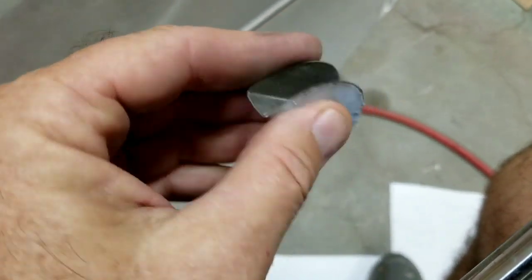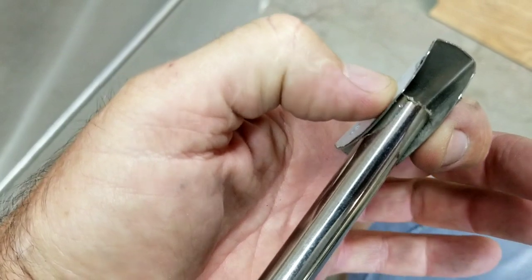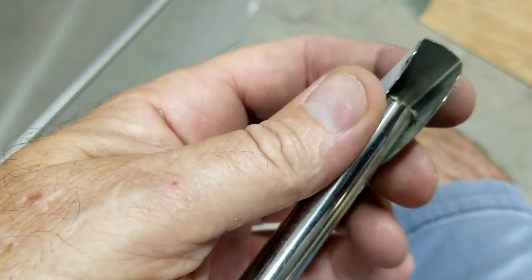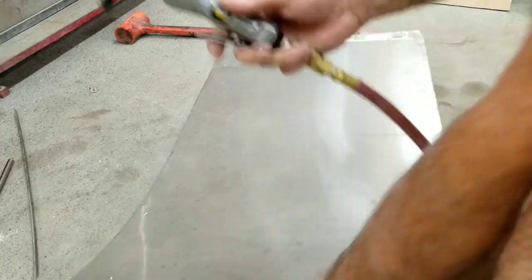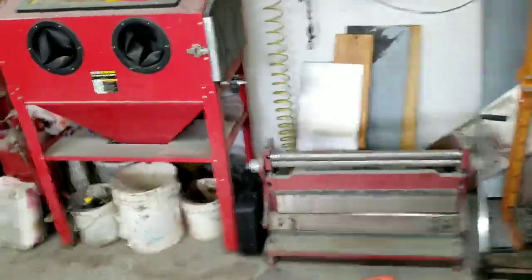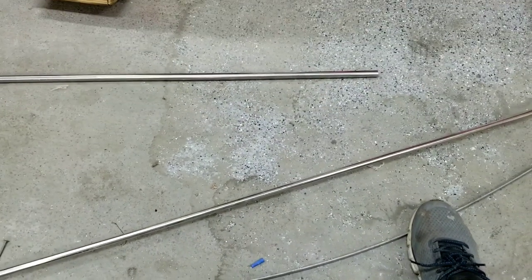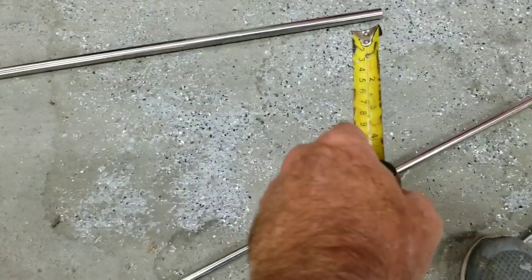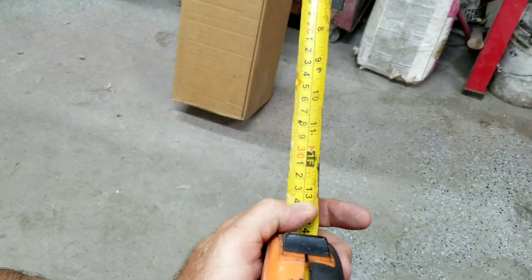When I peel this off, it's polished on this side - basically the same thing as what you saw in the video. Goes onto that tube like that. They had little rivets in here, but I could use rivets or screws - I'm probably just going to drill through and put a cotter key on there, because then it's easily fixable and serviceable. These two poles combined together need a distance of around 22 inches with overlap, so I'll make one piece 11 inches - actually I'll start with 13 inches, give myself a couple extra inches just in case.